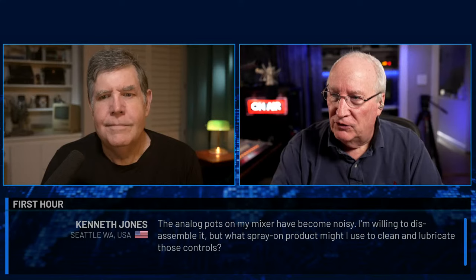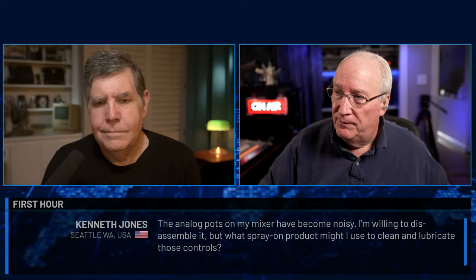First off is Kenneth Jones from Seattle, Washington, asking, the analog pots on my mixer become noisy. I'm willing to disassemble it, but what spray-on product might I use to clean and lubricate those controls? And we're going to start with Guy Cochran this morning. Yeah, we sell a lot of a product called Caig DeoxIT, but also Caig FaderLube. So you want to look up just on the good old Google or interwebs, Caig FaderLube, spray some of that on, and that should help clean up some of those scratchy faders.